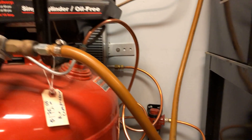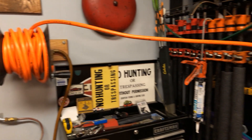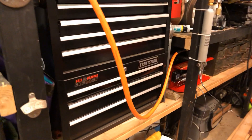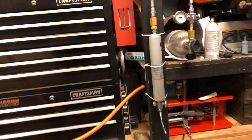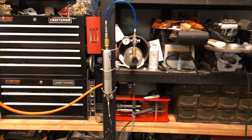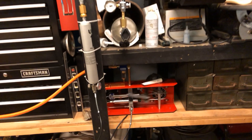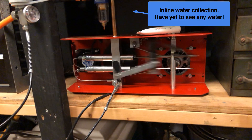We have the tank here regulated at 100 PSI, running all the way up and around entering the shoebox compressor. My wife is an avid gardener — she likes her hydrangeas up there drying out for the winter season. There's the shoebox compressor. I also added another inline water separator right before the shoebox compressor. I haven't seen any actual water droplets in it or had to empty it at all, so it may be overkill, but it's there just in case — it'll be interesting to see how it performs during the hotter, more humid summer months.